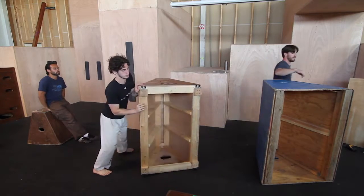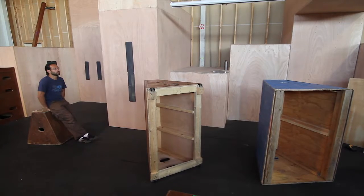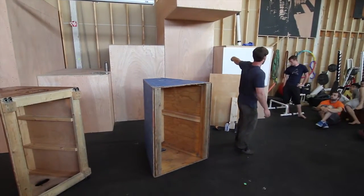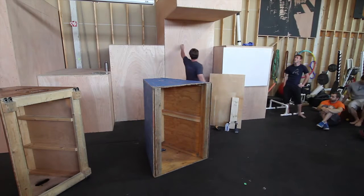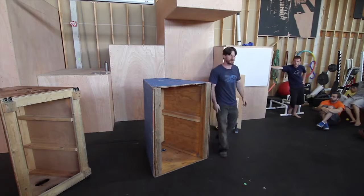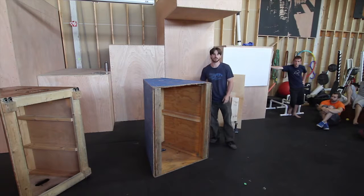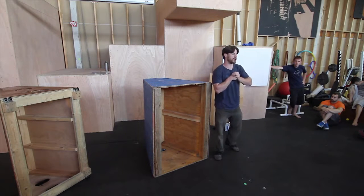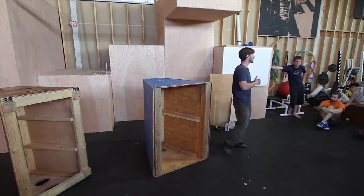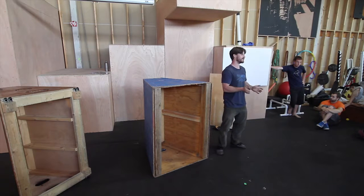When we sheet all of these things, we do 6 inches between every fastener on the outside edges of each sheet, and on the inside structural supports, we do every 8 inches. We got that from the rock climbing world. Well, actually, some rock climbing gyms use less, but it tends to work pretty well. If you're gluing and screwing or nailing, you can get away with more. But in general, fasteners are there to be used.